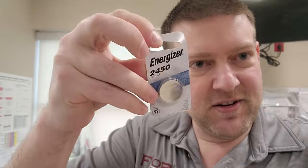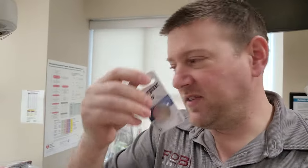So guys, these things have two things that have to happen every two years: the internal PM and you have to rebuild the blender. Blenders have to be done every two years because there's a lot of silicone and rubber valve seals and stuff inside that need attention, and things like moisture can contaminate it quite quickly. But these coin cells — everybody forgets these. So I'm going to show you guys real quick how to change out the little coin cells.